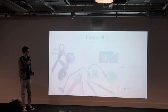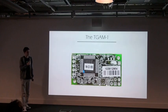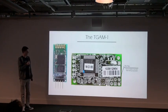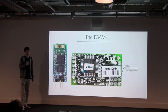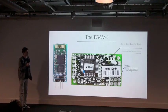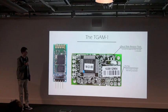I took a look at the datasheet and found that it communicated through serial. So I hooked up power, ground, and TX to an HC-06 Bluetooth module. It didn't work at first. Reading through the datasheet again, I found I had to solder some resistors in place to control the mode. After that it worked — I was getting hex values back over Bluetooth.